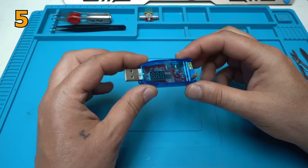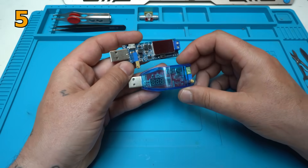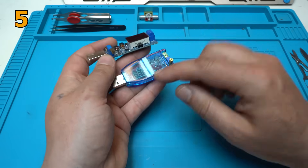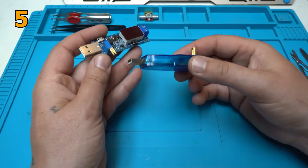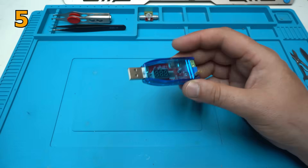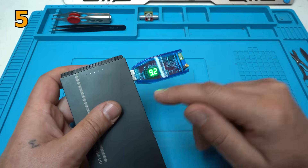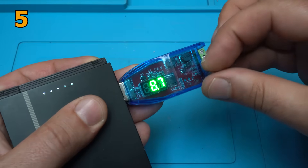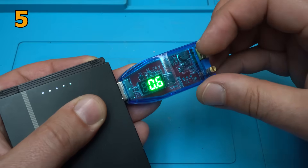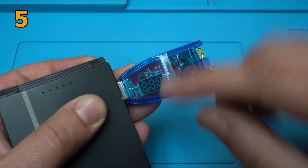What about this module, and what is the difference from the previous one? This one is a little bit smaller, has a smaller LED voltmeter, and comes with a beautiful transparent blue clear enclosure. It's essentially the same but more beautiful. It has a green LED voltmeter, and you can also adjust the voltage with a multi-turn potentiometer. The lowest output is about 0.6 volts — the input remember is 5 volts — this is a DC-DC converter, step-up step-down.